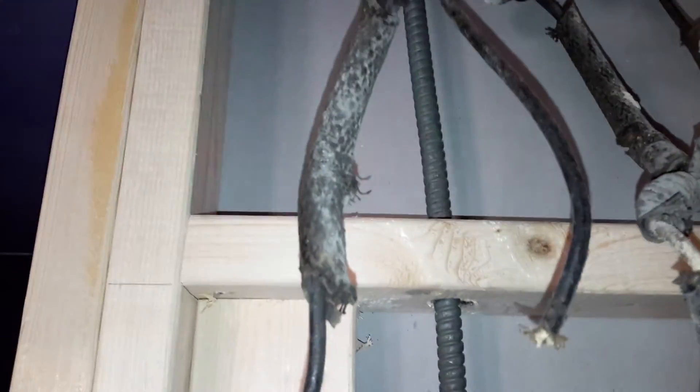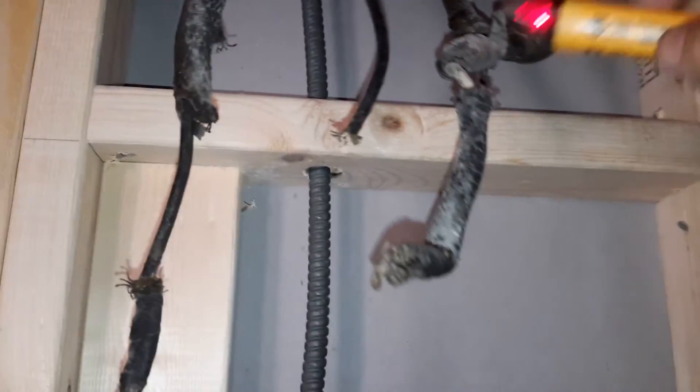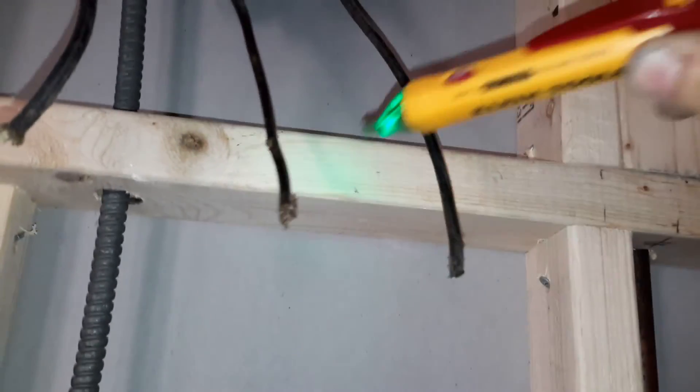The first thing I'm going to do is — I know both of these are hot coming down and back up, so this is power going to two different things. This must have been a tap for something else. I'm going to cut these apart and see what loses power. I shut circuit number four off, and obviously that took care of it since circuit four runs the whole thing — so there's no power here right now. I'll go ahead and cut that, then turn the electric back on. After cutting it and turning the electric back on, I can see I took something out of the circuit. This line used to go up and feed something but now it doesn't. I need to find out what in the house has no power and was fed from that line.